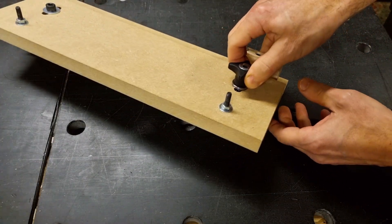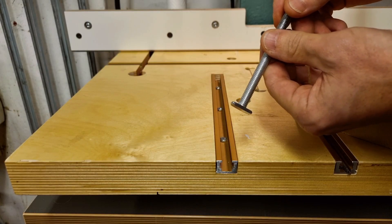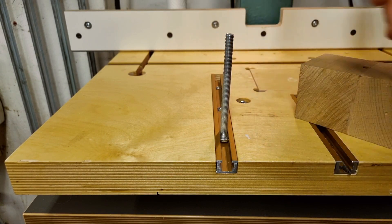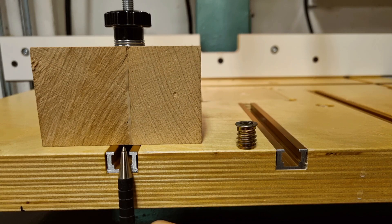The solution is to change to a knob or lever with longer threads. The second potential risk is related to what you use as a counterpart for the knob or lever — a threaded insert or a T-screw going into a T-track. As the axial bearing has the potential to almost double the clamping force, it has the same potential to put much higher load on your threaded inserts or T-tracks, increasing the risk of ripping out the insert or T-track from the base material. We have reached the end and I'm of the opinion that if it ain't broken, don't fix it. I don't recommend implementing these axial bearings on all your knobs and levers, but if you use them wisely, it's a very cheap, simple, and good trick for those situations when you need to increase the clamping force. Thanks for watching.